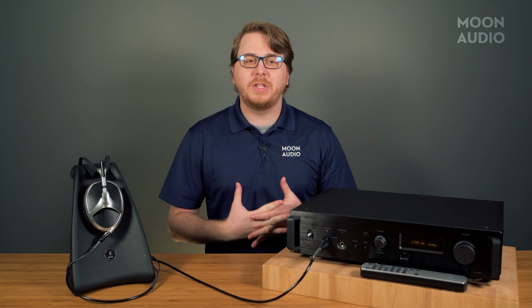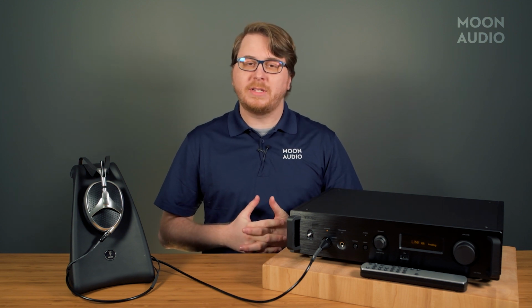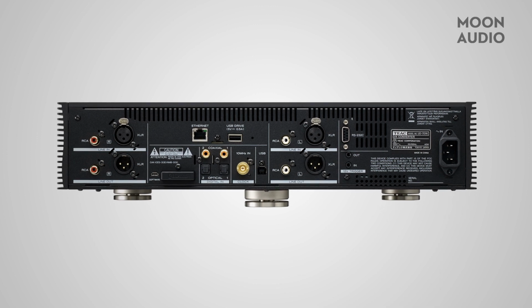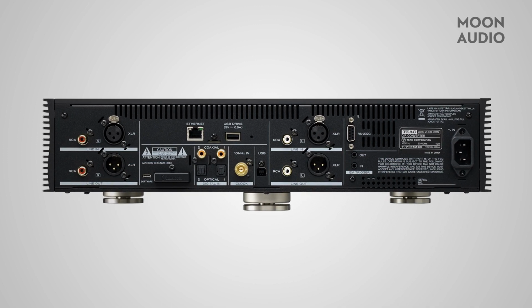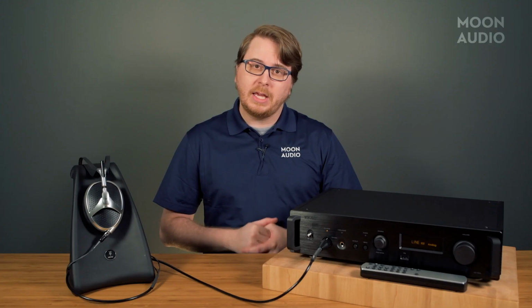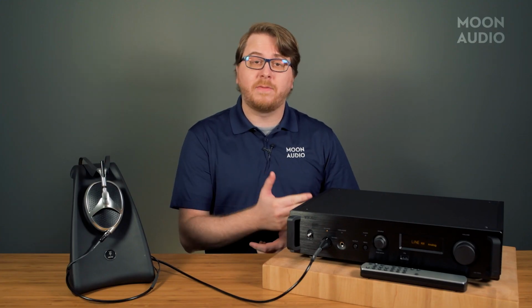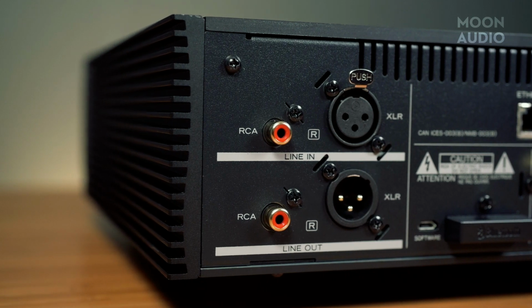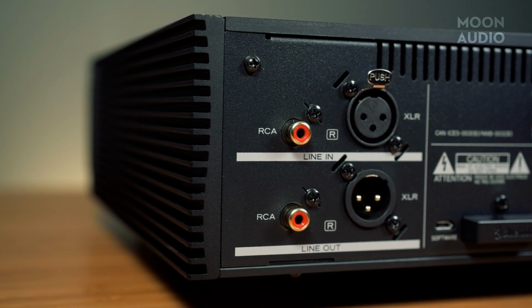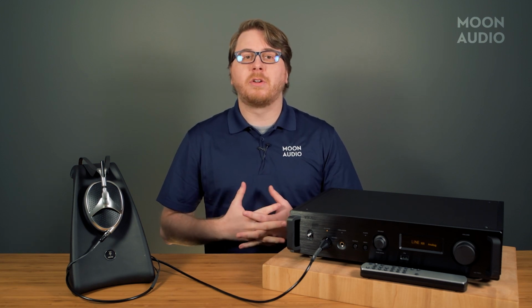In addition to using the minimum number of circuit board attachment screws, TEAC's original pinpoint feet utilize a new mechanism that suppresses vibrations from the bottom panel that affects audio quality. Even the length of the side fins of the device that are for heat dispersion have also been adjusted to prevent sympathetic vibrations. TEAC likes to do things their own way.